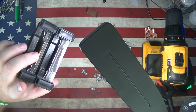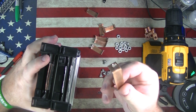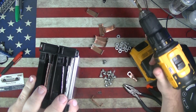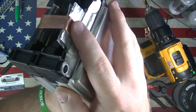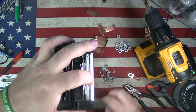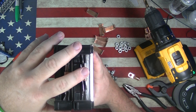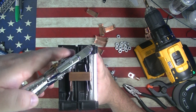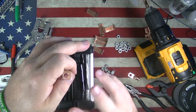The cleanest way to connect the tabs is with a jumper bus bar — line them up to get the most contact area while they still touch, so you can drill a hole through it. Combined with some aluminum quarter-20 nuts and bolts, this works well. I'm familiar with quarter-20 from standard equipment. I have a hole punch, and if I could find something sized to fit it, this would have been a whole lot easier instead of having to drill through the tabs and risk ripping them.